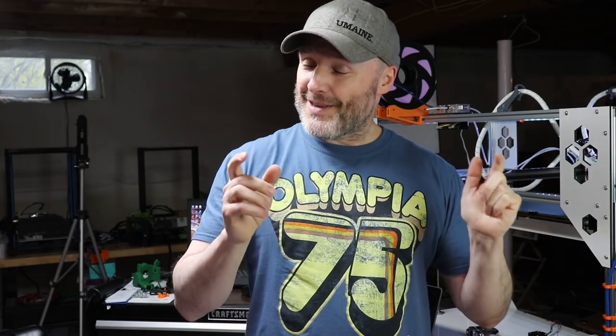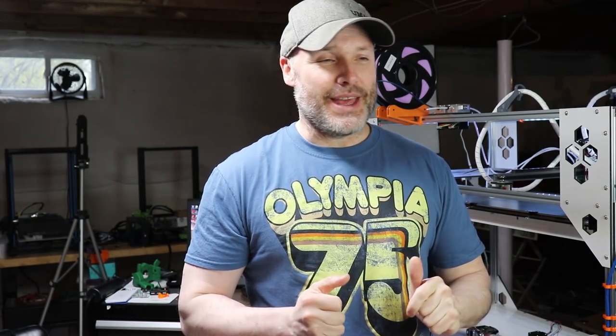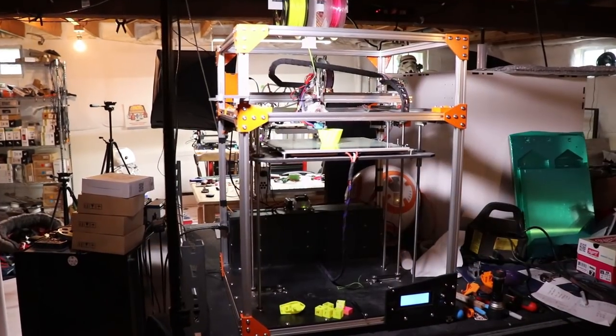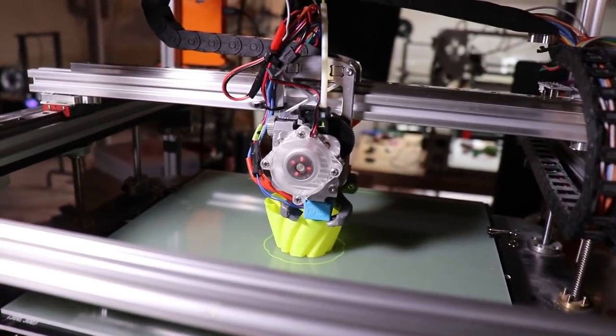Let me tell you about a couple of things I've been working on. You may be surprised to have heard the word FT-5. The FT-6 was really, really frustrating the dickens out of me and I needed a break from it, so I decided to jump into the FT-5. The FT-5 suffers from a bad bed — no matter what you do to it, if you level the outsides, the center is way off. The melamine bed is definitely the culprit. I've tried shimming it, I've tried all kinds of other things and it just was not working very well.